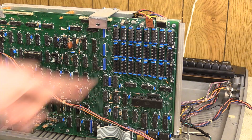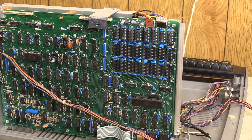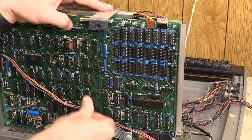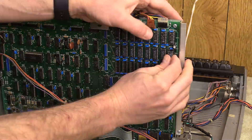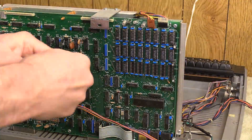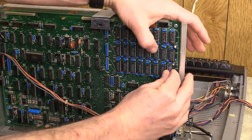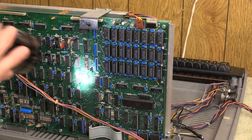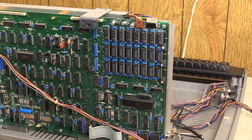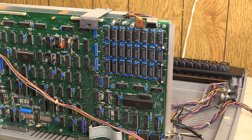These are Tandy-stamped with the Tandy hourglass — they're factory. I have my additional RAM here, so I'm going to get 16 of these chips out and put them right in. As you can see, the very last one I misaligned, so I caught that during the visual inspection.